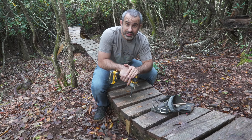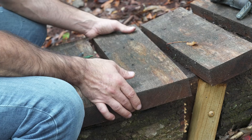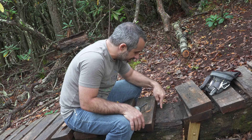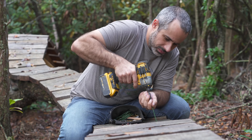Take your bets — is the head snapped off or did it rot inside the wood? We have a full three inch screw, but these planks are really thick, so there's not as much of this screw biting as you might think. It's filthy underneath this plank, but it's not rotten — actually in really good shape. That three inch screw might not have been long enough with the abuse this took. I'm going to do a full four holes with brand new positions and use the three and a half inch hardware.